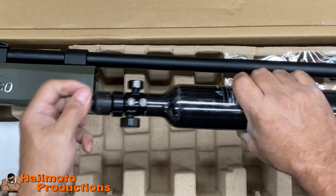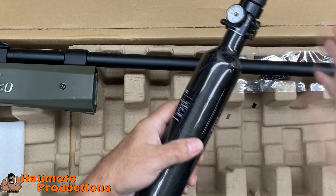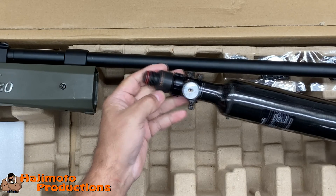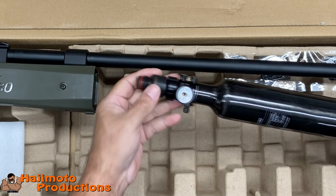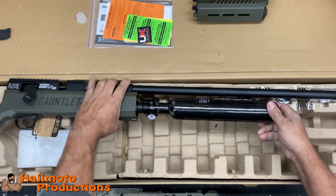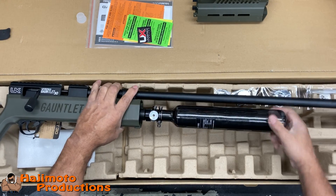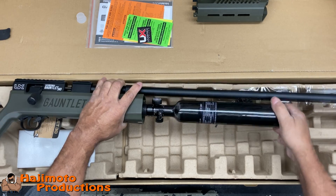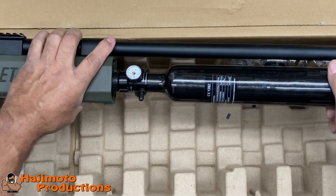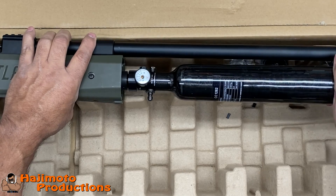The flex combo comes on the carbon fiber bottle — it is a 5/8 thread, not an M18. These are special bottles we had made. This is our flex reg that can be set for up to 3,100 psi. You're going to want to put the bottle on as tight as it'll go, fully seated, so we get a good idea of where it sits. We're pretty lucky on this one — all we have to do is turn back a little bit and it lines up perfectly.